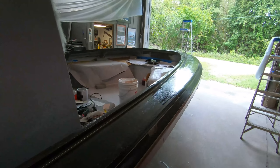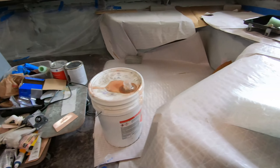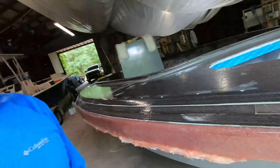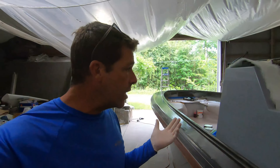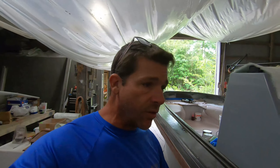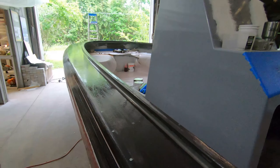For this first class of glass we've got everything taped and masked, with our resin mat pan staged and ready. Good glass work really comes down to good prep work. You want to be sure everything is clean and dry, with the right temperatures and humidity — usually 50 to 75 degrees is awesome, fairly low humidity if possible. Everything should be dust-free, clean, and dry.